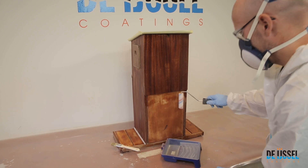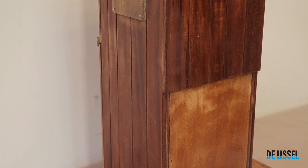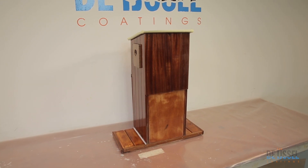After 14 days curing at 20 degrees Celsius, sanding with P180 and degreasing with double coat degreaser, a first coat of double coat WV or double coat Karat may be applied. Good luck.